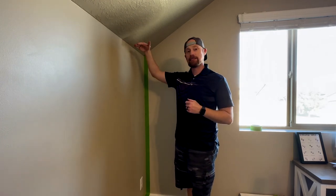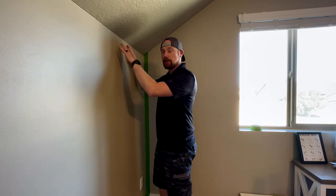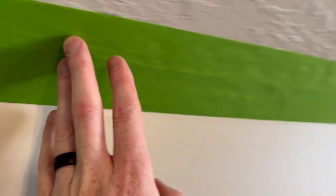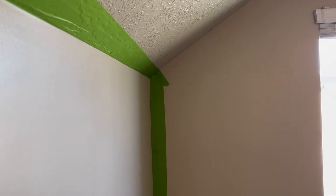I like to pull it out far and then put a section down at one time, keeping the tape nice and firm. This is a bonus room above the garage and you'll notice it has slanted ceilings because of the roof. One good point is the wall is much closer to me so I don't have to get up on a ladder. To help prevent getting paint on the ceiling or side wall, I ran another row of tape. That uses quite a lot more tape, but I was trying to have less cleanup as possible.